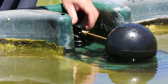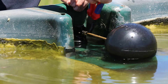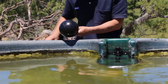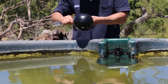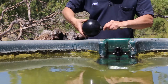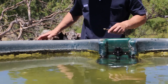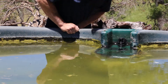You may wish to adjust the water level at which the valve shuts. In this case, the trough has a shallow cavity and we need to adjust the float up so it can fully open and close. To adjust the float valve lever arm, use pliers to remove the R-clip on the pivot pin and then slide the pivot pin out. Depending on the length of your float valve arm, you may need to remove the float to safely bend the arm. This can be done over the edge of your trough or with a pair of multi-grips.